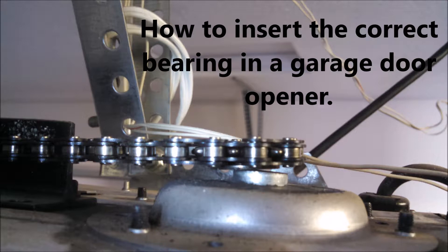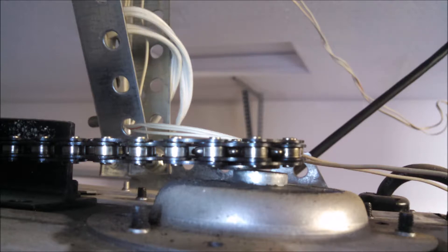The cause appears to be, at least with both my units, the sprocket bearing on the top of the unit — part of the actual opener assembly. In both cases, I had no bearing. I don't think it's a real bearing; I think it's a bushing. It's just garbage. It deteriorates pretty quickly over time, and I'm sure a lot of homeowners don't realize it. In some cases, the garage door opener will open partially and then shut, because the load on the motor is too much and the motor will automatically shut down or reverse to close the garage door.